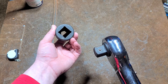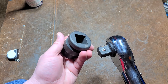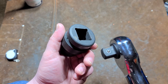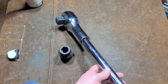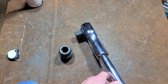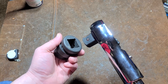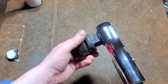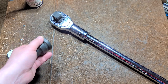I primarily have it because I've built up quite a collection of inch-drive sockets for really recalcitrant, really stuck bolts. This is just a small seven-eighths fastener, but many times people will be working on axle nuts on front-wheel-drive passenger vehicles. If you're from the rust belt, sometimes those things can be really stuck — even difficult for three-quarter-inch drive. That's why inch drive really is the big heavy-duty drive size.